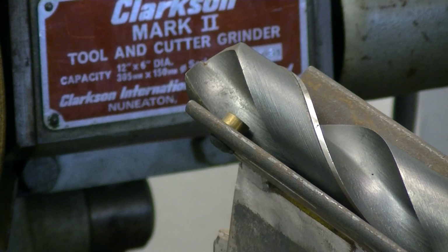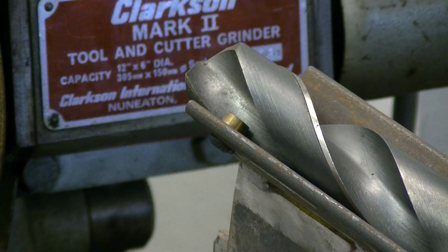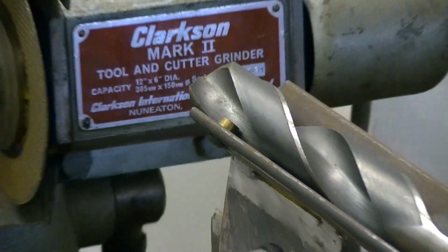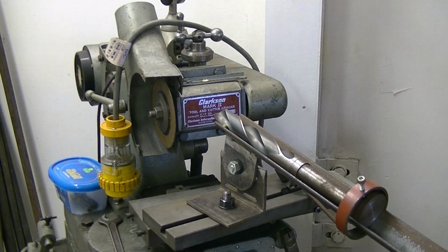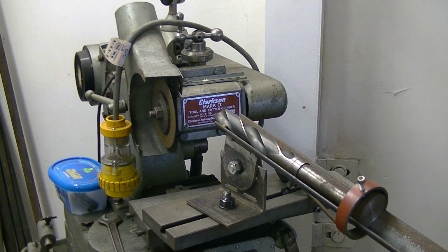When you get to larger drills, I put the brass button in this slot here and I can manoeuvre it along to get in position on the flute with that cutting edge horizontal. Quite easy to build. I have seen this copied by one of my viewers, and he improved it by putting the pivot point substantially further back on the body to get more protrusion at the front.